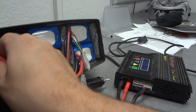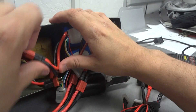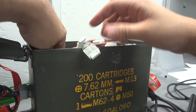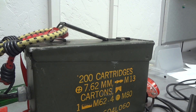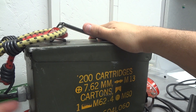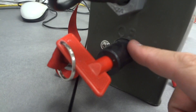When you're done charging, you reconnect in series, put the packs back in, connect here, put them in, connect here, put them in, start the battery up, and make sure all cables are tucked inside. This is a good enclosure because it's a hard case — in case of a thermal runaway reaction, everything is contained here so you won't have a burning problem. Some people have recommended I add a vent hole in case of expansion, but I haven't done that. This is a weatherproofing conduit with a rubber stopper; I made a hole to pass the wires through — it's really that simple.